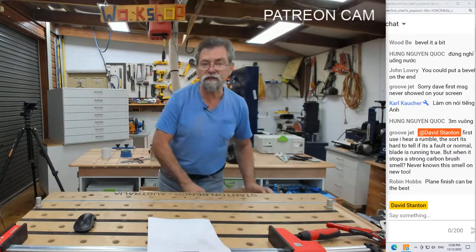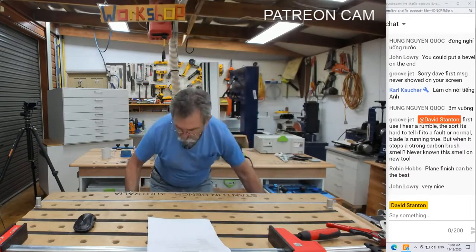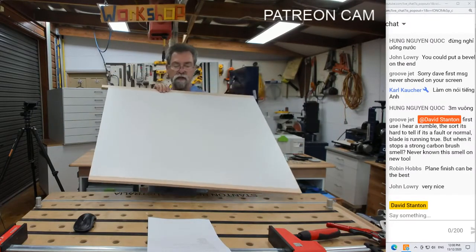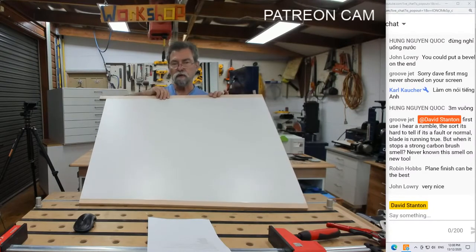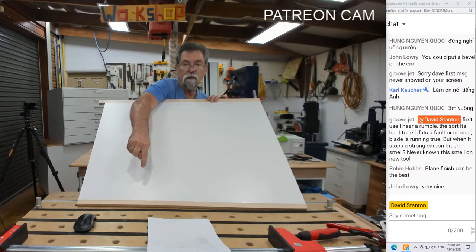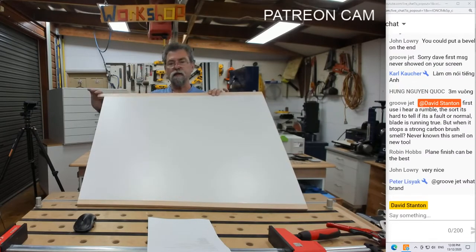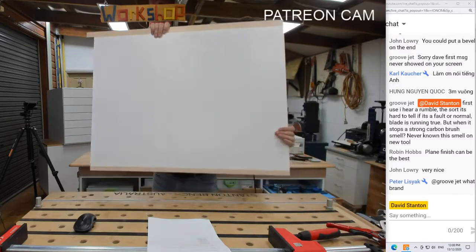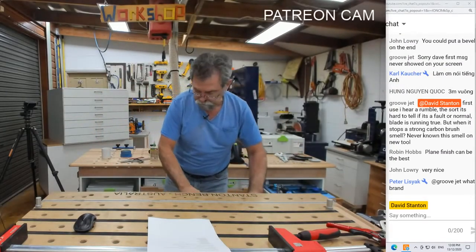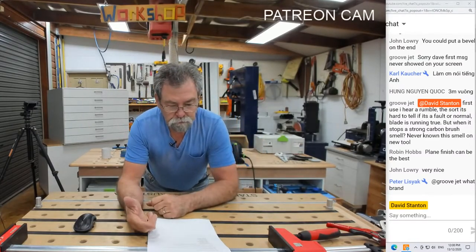This, if you're wondering what this is, is the door to the hopper that I'm making. Now, the reason I'm putting the edge strip on the timber is because I'm going to use piano hinge, and I don't like going to the side of particle board with piano hinges. So I'll be putting the piano hinge into that piece at the bottom. This is just to make it feel nice at the top, so Vicky's fair hands won't get cut or scratched or anything. How nice is that?